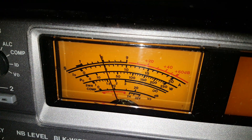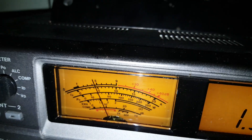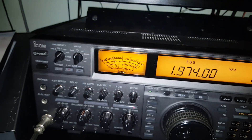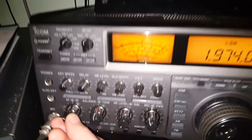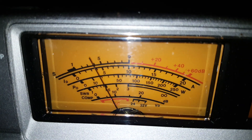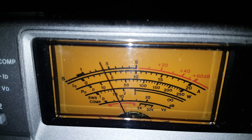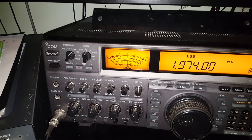You can tweak this for hours — a little bit of gain adjustment and here's a bit of phase. You can go backwards and forwards for hours, but we're now actually hearing a conversation taking place on this frequency — we certainly weren't hearing that before. Let's just switch the device in and out so you get an idea. Here is in — and now switched out — switched in — switched out. I think that's a fairly convincing demonstration of how much noise we're actually cancelling at the moment with this device.